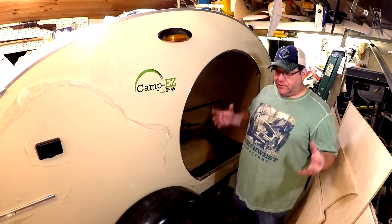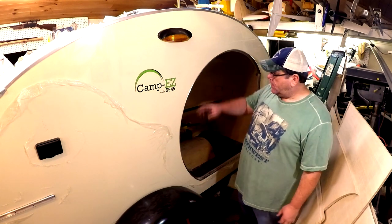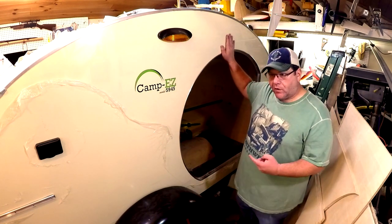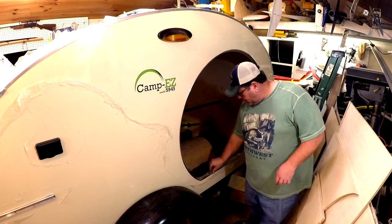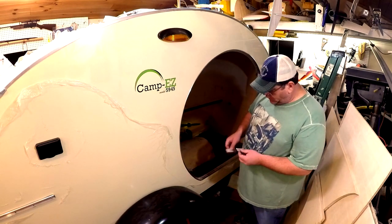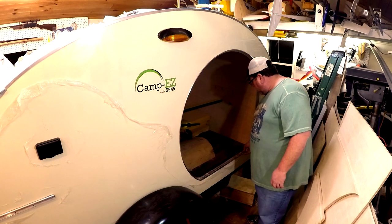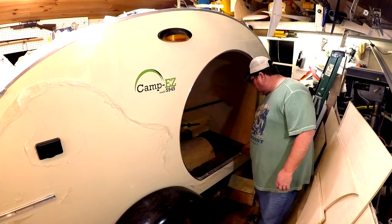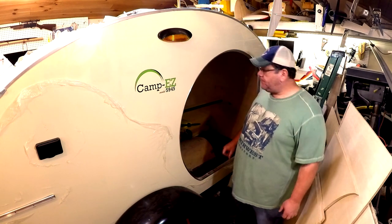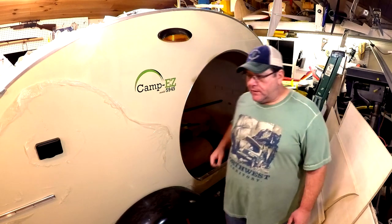I have the T and L molding trim around the first door now. I'm going to try to fit it inside the hole in the wall of the camper. I put a couple of shims on the bottom of the door frame — towards the back and towards the front — just to make sure I've got a little space between the bottom of the door and the bottom of the frame. I'm hoping I'll have about an even space all the way around, so let me get the door and we'll find out.